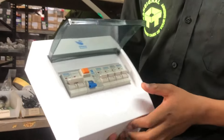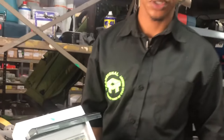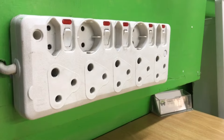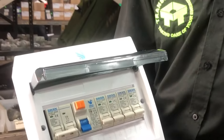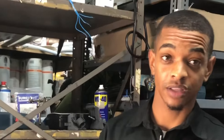Switch off all the circuit breakers and unplug everything in your house — your fridge, your TVs, your kettles, toasters, pool pumps, and don't forget the multi plugs. We're going to switch on the breakers one by one, starting with the mains and the earth leakage.